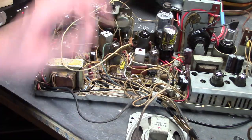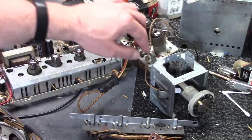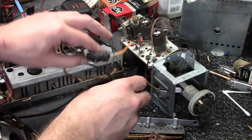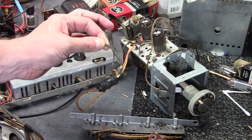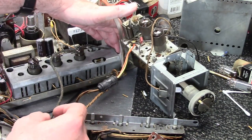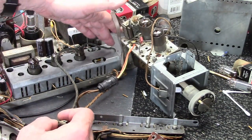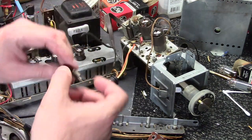Another specialty wire is on the tuner, which has an RCA connector on the end - again, coax. This I think you could replace with 75 ohm type coax with an RCA connector on the end. The end going into the set is just hardwired in, with the braided shielding going right to the IF shield and the inner conductor going to the IF board.